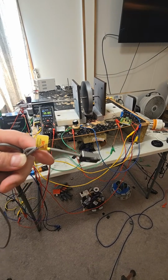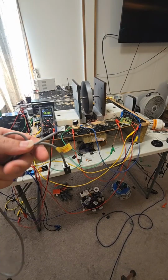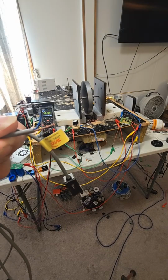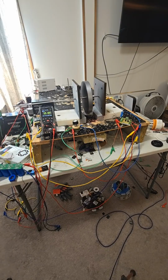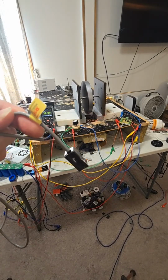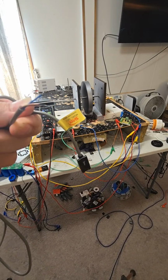you got this one right here. It's a reed switch because it's got the two input and output. There's no third one like a Hall effect has. I heard somebody try and call this a Hall effect sensor. It is not a Hall effect. It is a reed switch.